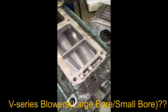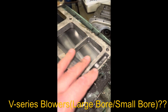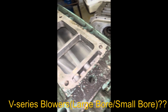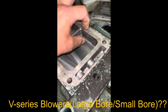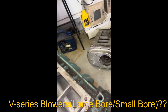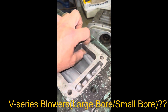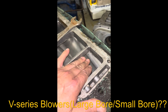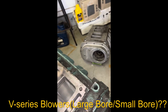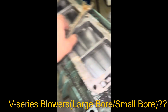There's been some confusion about identifying large bore versus small bore Detroit or GM blowers out there. The key is the case thickness at the top and bottom — you need to measure to determine that. They say that if it's a small bore, this will be thicker, obviously limiting the internal volume. A 7/8" thickness indicates a small bore.